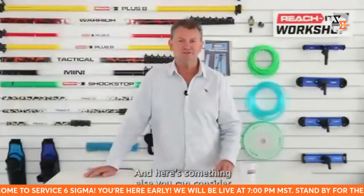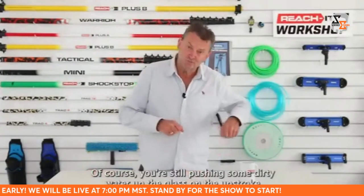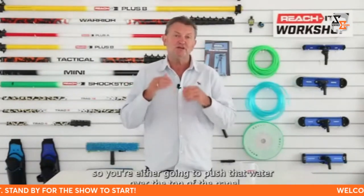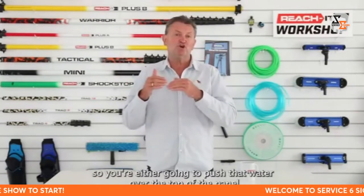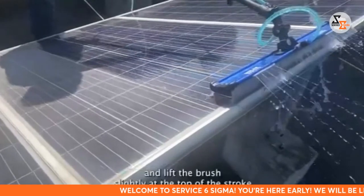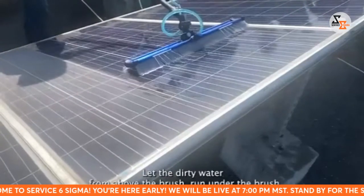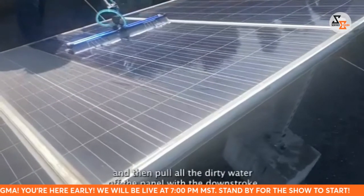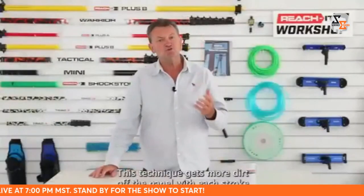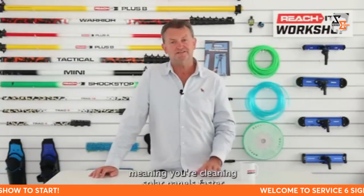And here's something else you can consider. You can actually change your cleaning technique. Of course, you're still pushing some dirty water up the glass in the upstroke. So you're either going to push that water over the top of the panel or stop a little short of the extreme edge of the panel and lift the brush slightly at the top of the stroke. Let the dirty water from above the brush run under the brush and then pull all the dirty water off the panel with the downstroke. This technique gets more dirt off the panel with each stroke, meaning you're cleaning solar panels faster.